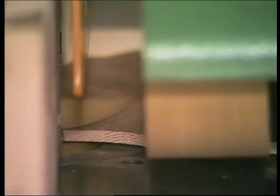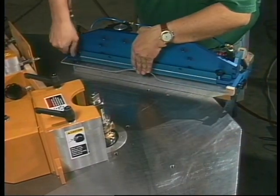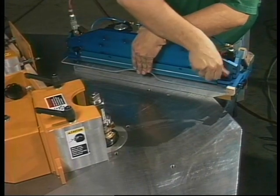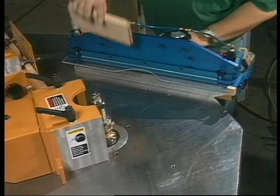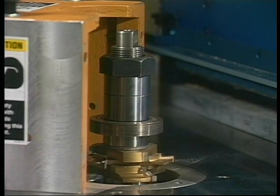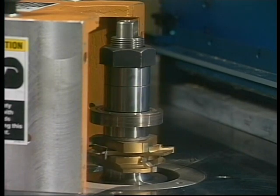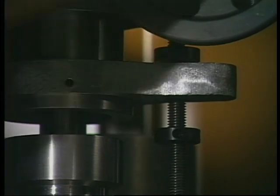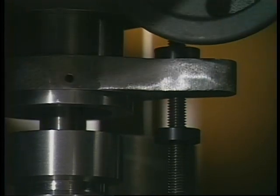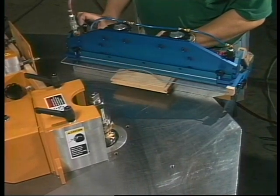Finished sanding time is virtually eliminated due to the 6,100 RPM spindle and constant rate of feed. Next, the sticks or styles are machined at station number three. The cathedral arch rails are machined first, with the aid of our arch template system, a guide bearing and a template. Ten rail arch templates are standard. Station number three, the sticking station, is powered by a five horsepower spindle drive motor, with the one and a quarter inch diameter spindle set at 8,600 RPM. The spindle height is adjusted to the upper stop setting to accurately set the cutter. This self-centering feature accurately aligns the coped rails in relationship to the template.